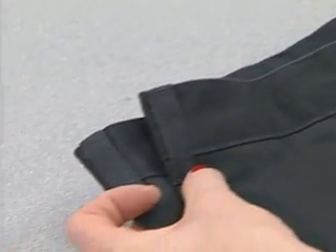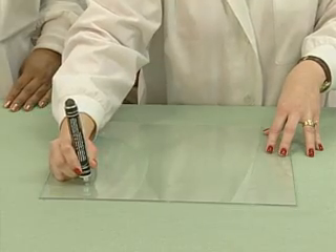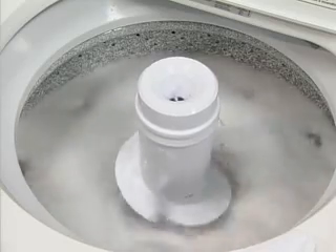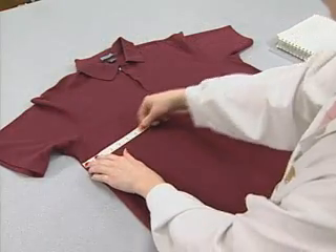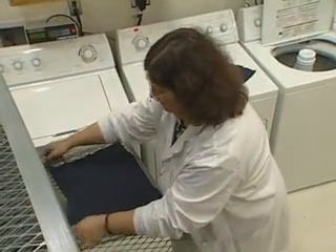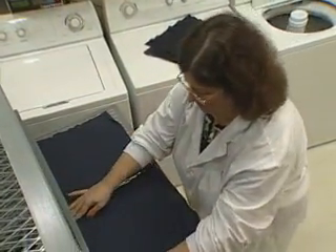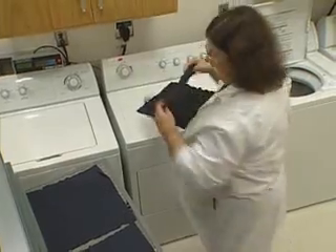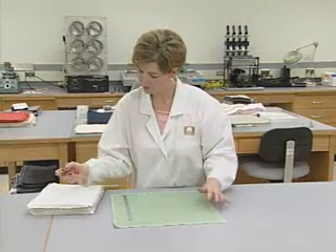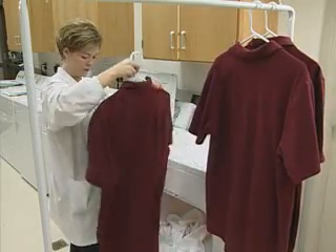There are many methods for measuring the shrinkage of cotton fabrics and garments. The most reliable methods use a system that properly prepares the sample for the test, will agitate the goods without tensions or restrictions during wet agitation, and accurately measure the results. The two most adopted test methods around the world are the AATCC Test Method 135, titled Dimensional Changes of Fabrics After Home Laundering, and Test Method 150, titled Dimensional Changes of Garments After Home Laundering. These procedures are used to predict dimensional changes that occur after home washing and drying.